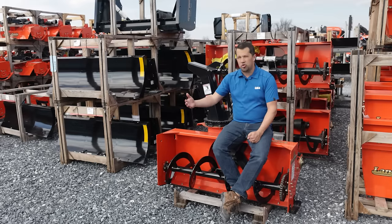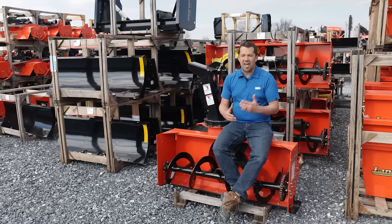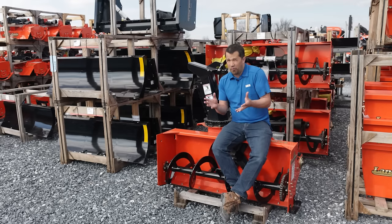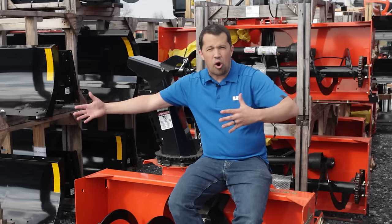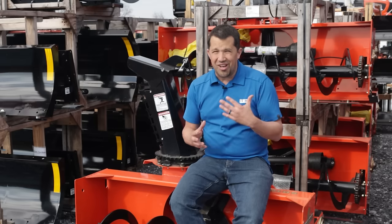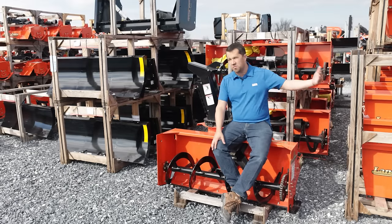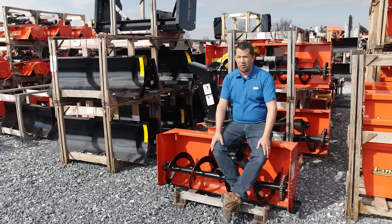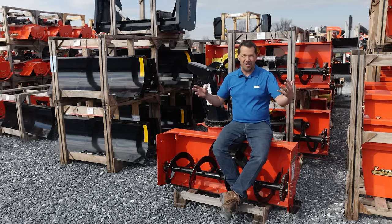But if you have a longer driveway or you're trying not to mar your surfaces with a metal edge, there are a lot of other attachments that can be more productive and at surprisingly low cost. Something as simple as adding a push box on your front end loader allows you to clean out large areas and parking areas much better than you can with a loader bucket. Blades and snow blowers can be very productive implements if you have to clear larger amounts of snow. These things exist at a variety of price points, right? The smallest push boxes can be down under $1,000 and give you that simple iron implement that's never going to break, that you can pull out when you get a good snowfall.